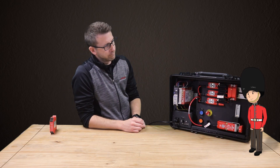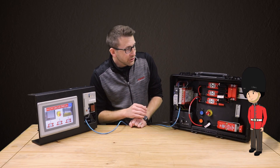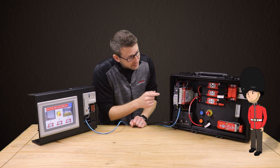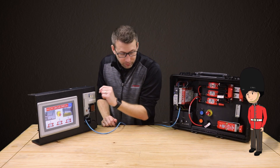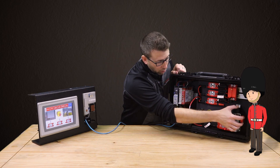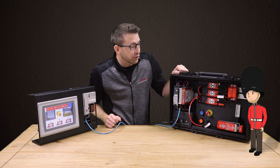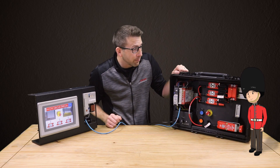That is way more than one thing — you just listed off four more wishes. Sounds like some fancy diagnostics. I wish for full diagnostics over GuardLink! Sir Guardmaster, your safety relay just got a huge upgrade. We have Ethernet comms going from the HMI to the PLC to our safety relay via this side Ethernet adapter. I can visually get indication of each device on the HMI remotely, and I can even unlock the guard locking switch with the touch of a button. Open the door, close it, lock it. You can even send all this data to your Rockwell Automation PLC to troubleshoot remotely and track the frequency of each device's trip, not to mention a remote reset on your HMI to the safety relay.